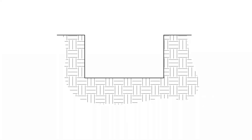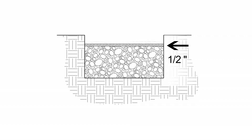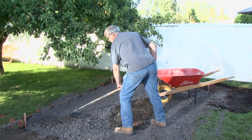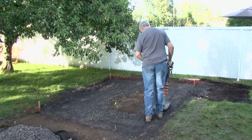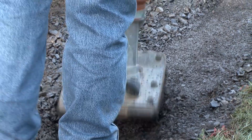These are the foundation detailed procedures of your wall. You have already dug 12 inches down. Fill 10 inches of 0¾ crushed stone, which after compacting will reduce to 9 inches. Fill half an inch of stone dust. The first row of modules will be half buried. Fill the trench with 10 inches of 0¾ crushed stone and level it with a rake. To facilitate compaction, you can hose down the surface. Use the mechanical tamper to compact the entire surface and overlap the strokes of the tamper.